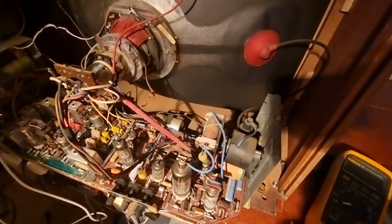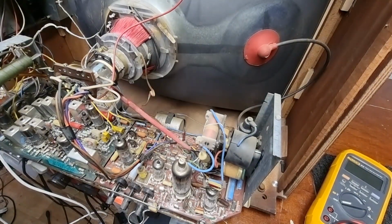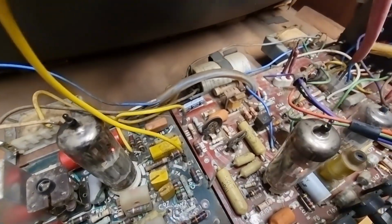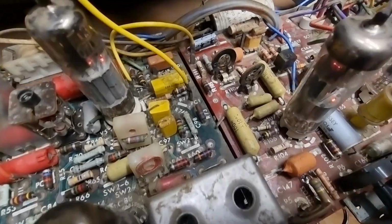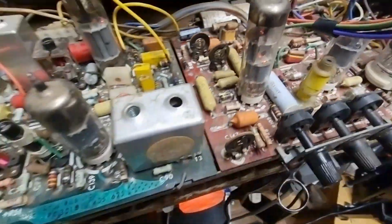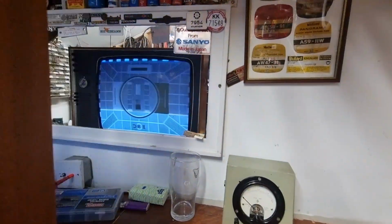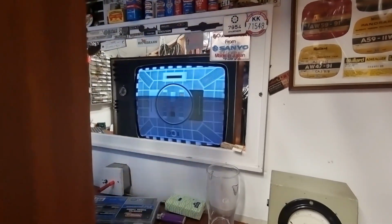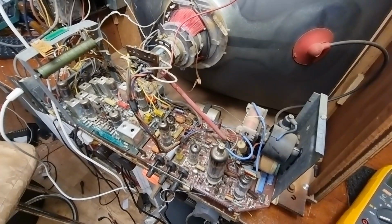So we have replaced several resistors, and we're a bit better than we were. Well, we have our lines up pretty good. So we replaced R110, R109, and R107 in there. And what have we got for our efforts? Relatively linear. A frame scan indeed. Not bad. We'll turn the television around and we'll have a closer look at the test card.